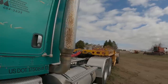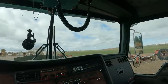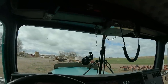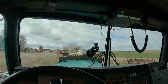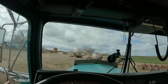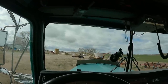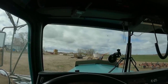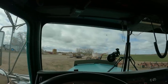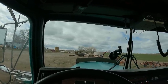So you notice those 24s don't have as nasty a rattle as a Cat engine. They got huge pre-cups in them, they're big. But one of the things we've discovered with a TD24 is if you set the timing to 5 degrees after top dead center, those things will have more power than you can believe. They'll just sit there and spin the tracks. But if you set them at 5 degrees before top dead center, they will rattle like a 1693 and have no power. And so all of ours have all been timed to 5 degrees after top dead center.